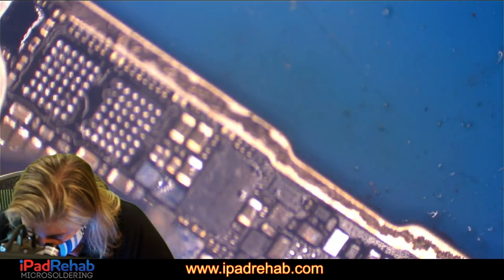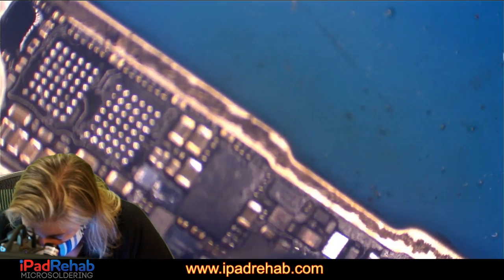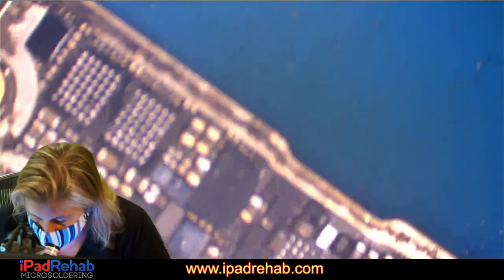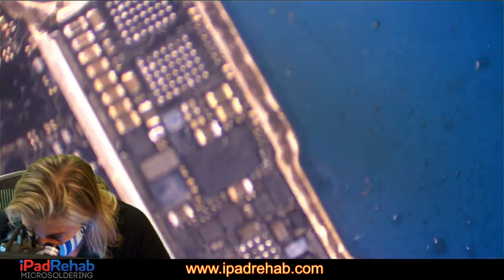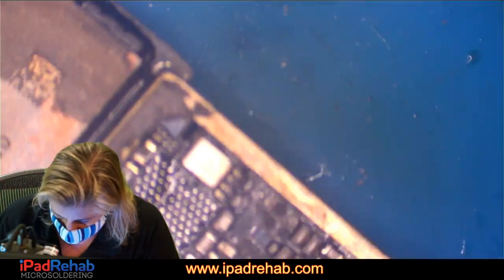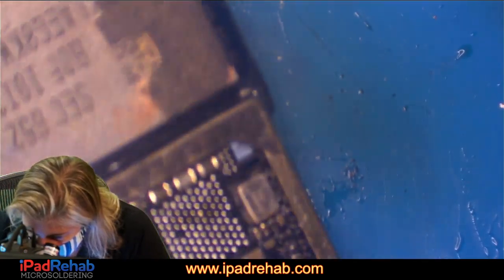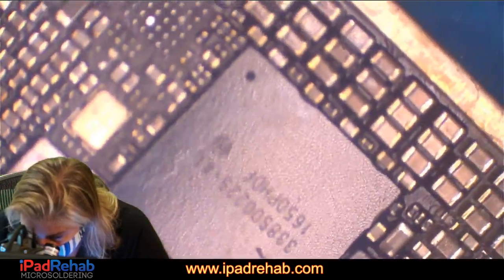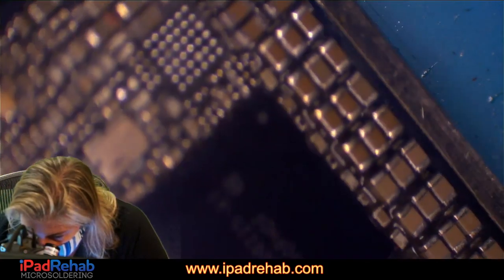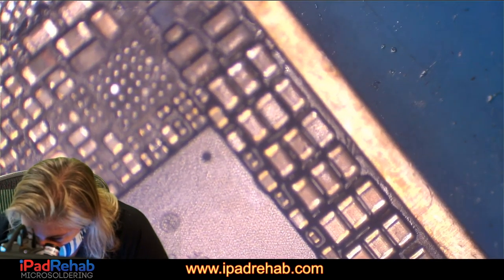That needs a little bit more juice under there. Okay. Now we gotta let that cool down. And let's keep hunting. That's pretty hot. Let's keep hunting. What else could be the reason why there is a 200 milliamp draw? What sort of other weird and minor line could be short?